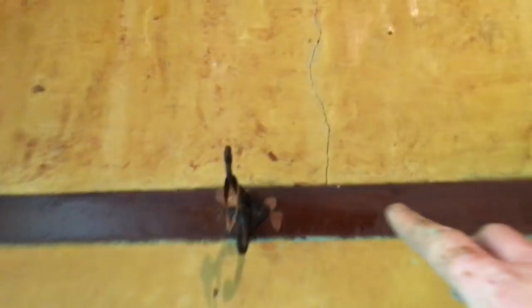The room is done as far as removing wallpaper from the walls. That there was underneath the wallpaper — some sort of cloth over what looks like an old newspaper, but I couldn't pick out a date on it. Now I'll go through and pick out these cracks, gouge them out, fill them in with more plaster, and get them all fixed. There are some spots right here that are probably going to be a big hole — I bet if I cut into it, it'll go all the way across the wall.